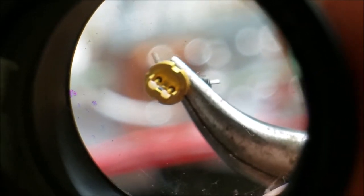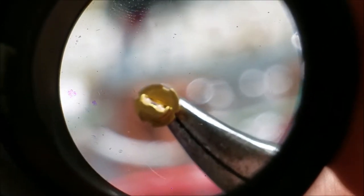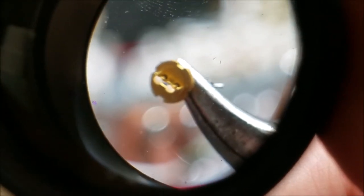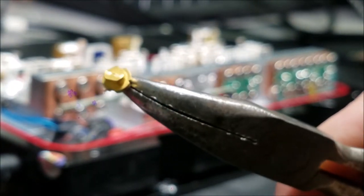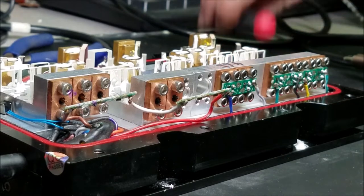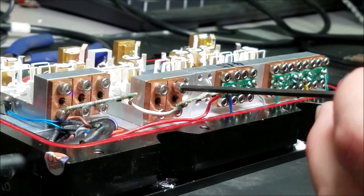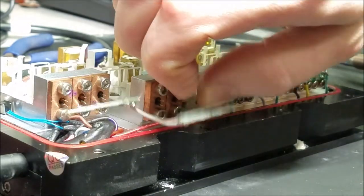But there's a little cylindrical lens on the front of that laser diode, and what that does is it corrects the output. It's fast axis correction, and you'll see that on some laser diode descriptions where it says FAC lens. That's what a FAC lens is. So these have that cylindrical lens on the front of the die. They help with the output formation and correction of the beam. The problem is that these are all also open can, which means that they are exposed to the elements somewhat, and they can get damaged pretty easily. Things like dust or moisture can get on the actual die itself and damage it, which is no bueno.